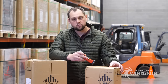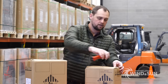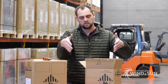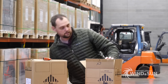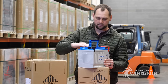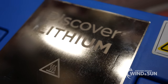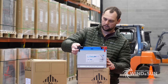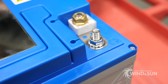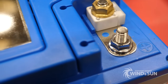This right here is the 12 volt 100 amp hour battery. It's a Group 24 battery, so it's quite a bit smaller than your average lithium battery, which is going to make a pretty big difference in the boxes you're going to put these in. It's got hold-downs on the sides, a nice aluminum heat sink on the top — I imagine that's for the BMS. Nice little insulated caps. It's got a fuse here on the positive terminal, so it's a fused battery, and this is a replaceable fuse.